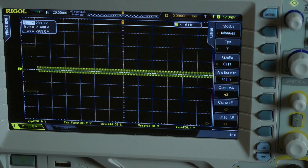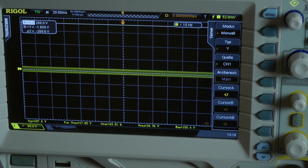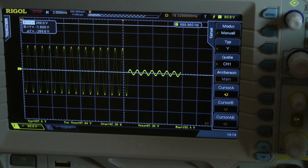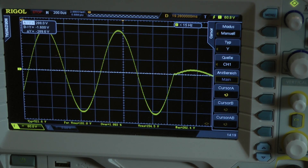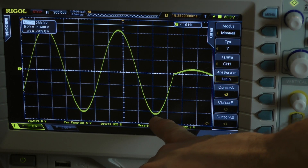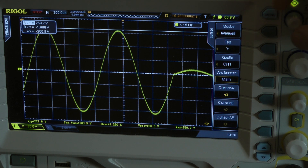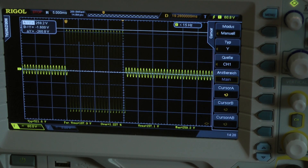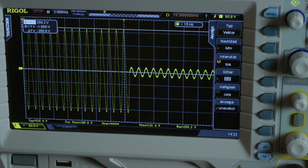Now I'm testing for dynamic power — burst with 1 kilohertz, 20 cycles, and a continuous signal between the bursts with a reduction of 20 dB. I have no clipping at the amplifier; the clip LEDs are slightly illuminating — that looks okay. I reduce because I have light signs of clipping on the negative waveform. I got a peak voltage of 259.2 volts, with all cycles at the same voltage level — that's the goal. The amplifier delivers 1076 watts into an 8 ohm load per channel, both channels driven into full power.